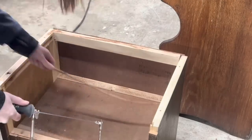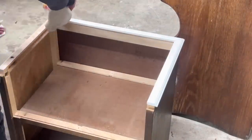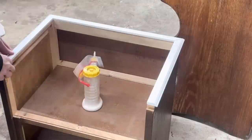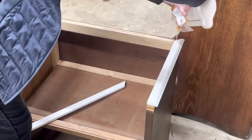This top back portion was going to be a little bit too high, so I just did a flush cut on it so I could attach the trim. That's a coping saw — it's a great little saw. I could have also used my pull saw; that one was just closer.